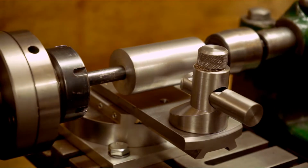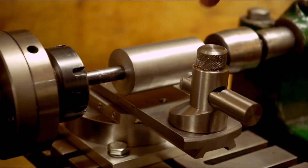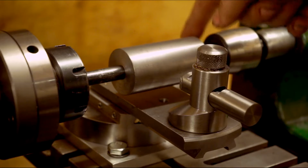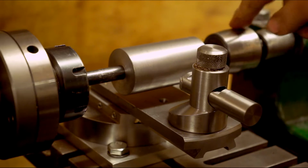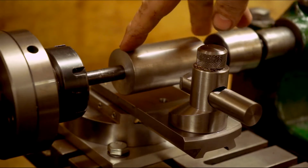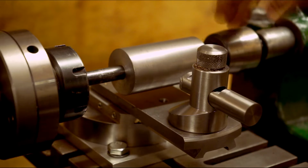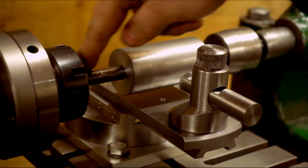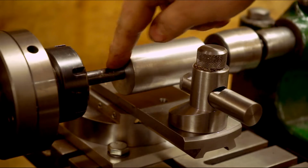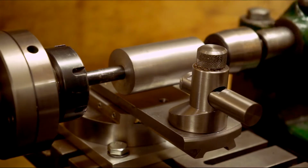Right, on with it. So I just move it by hand. Everyone tends to use a bar, but if you use a bar attached to the actual jig, you're swinging it round, the tailstock gets in the way. I need a tailstock for this protrusion from the chuck, and also it's only a 1/2 inch bar, so there is quite a bit of deflection if I don't use it. I am tempted to attempt it without the tailstock, to be honest.